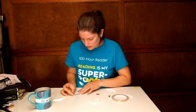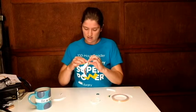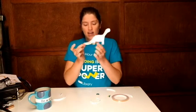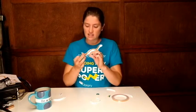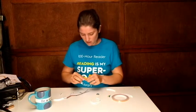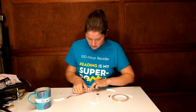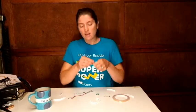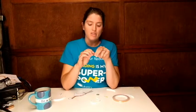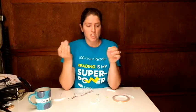This piece goes down the leg and then it wraps around like that. So now I have a piece here, and when I put my battery in I can take this tail piece and touch it right there, which is very handy. Now we're going to put in our LEDs. If you want all of them to light up, you need to make sure that you put the long leg of the LED on either the front or the back consistently each time.